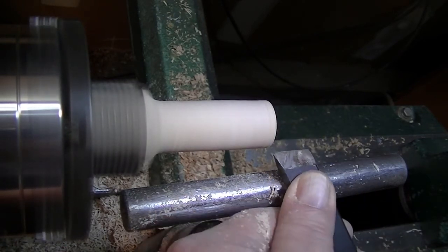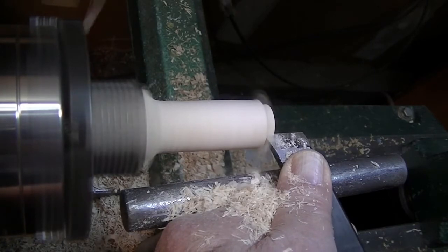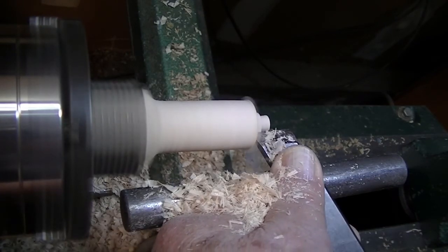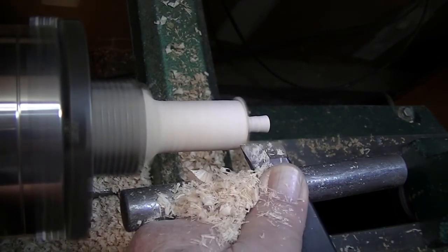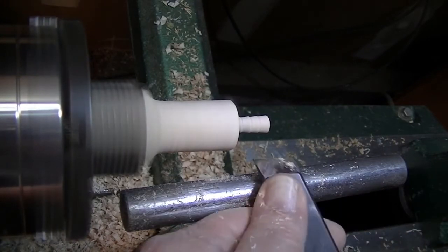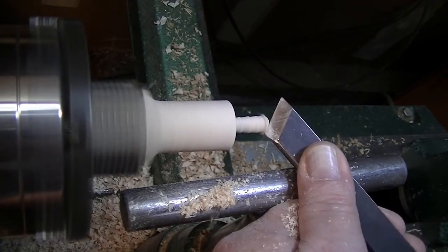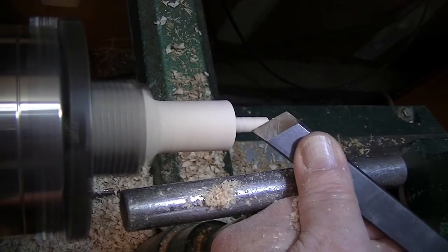started. Now, I'm going to do the same thing on the spindle. Let's go back to the classic top first. It's my peel cut. Dancing forward and in and down. A little longer. That's pretty good. Maybe just a bit more. Now I'm going to plane this smooth. And I'm going to use the toe so I can get down in here tighter.